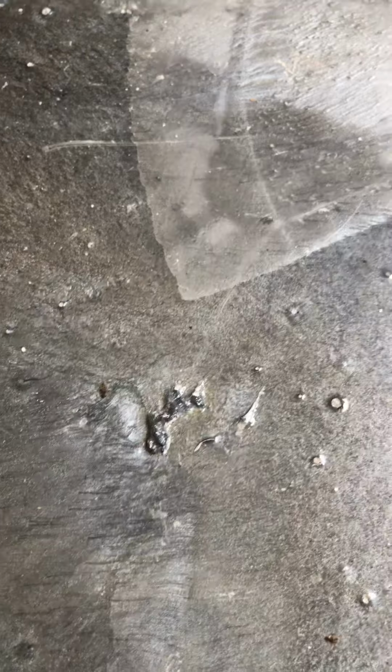No, they don't. All right, so you can see there's a clump of material. That piece, that's from it hardening too fast. That's not lint from the roller. And this section here I'm showing you was done in direct sunlight. It won't adhere or cover in direct sunlight. There's just too much degassing going on.